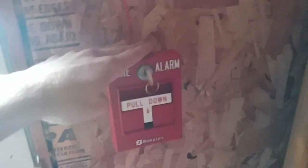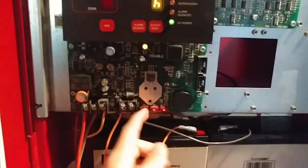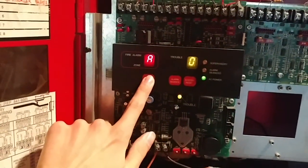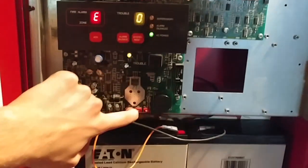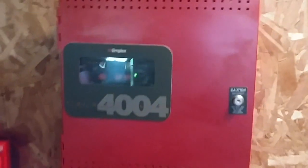And that is the Simplex 299-9754. The system will be set to continuous. And maybe while I'm at it, I'll show you how I change the tone option on this thing. What you're going to do is flip this DIP switch, press Acknowledge, and on the door you can see all these different programming options. Go to letter E, which is your tone option — press Acknowledge. Option 3 is 120 beats per minute march time, this is simple coding, and 0 is continuous or steady. To change it back to normal, just flip the switch back. That's how you change the tone option.